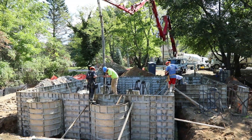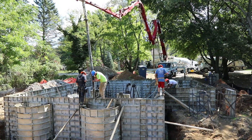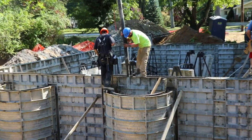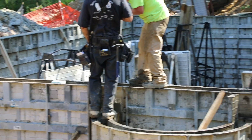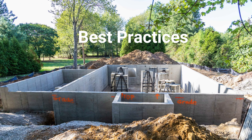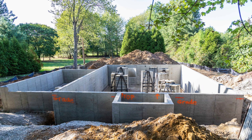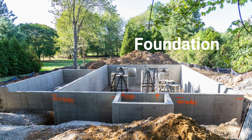One other critical piece to the foundation wall pour is making sure they don't leave any voids in it. We want it to be one solid mass — any voids will create a weak spot in the wall. They're very careful placing that concrete to make sure all the gaps between the forms are full. Another best practice is to use a minimum design strength for the concrete of 2,500 pounds per square inch for the footings and a minimum of 3,000 pounds per square inch for the walls.